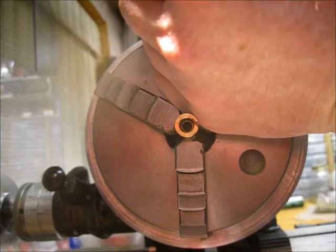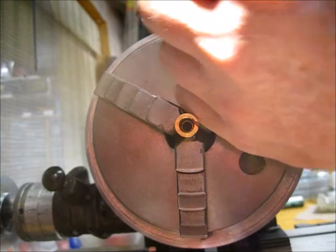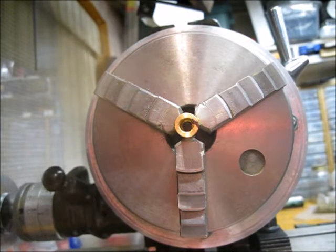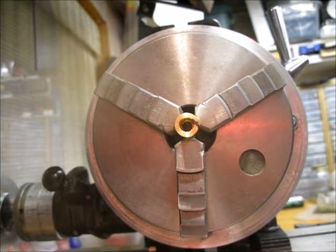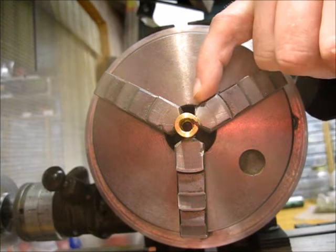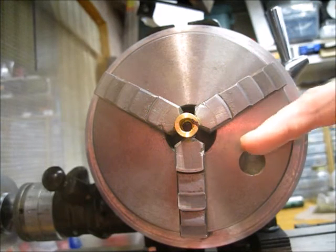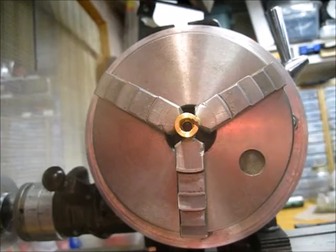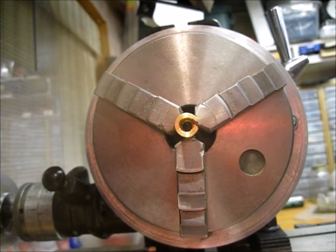The tip on the center drill is 1.2 millimeters, which is slightly smaller than what I need for all the holes, so I should be good there. So now it's just a matter of drilling the pilot for the set screw, and drilling the pilot for the alignment pin, which wasn't in the original plans, but I'm adding because instead of making this a press fit with an extra shoulder on the back side, I made everything from the front side and drilled all the way through, so there's no stop to prevent this from sliding too far up the stepper motor shaft.